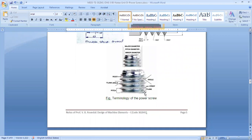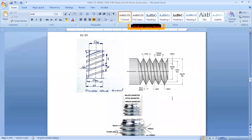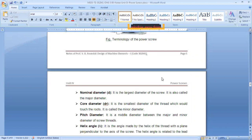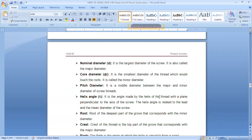In this actual photo of a screw, the smaller diameter is the core or minor diameter, the largest is the major diameter, and pitch circle diameter is shown at the center. Root, crest, flank angle, and pitch are all labeled. For this single start screw, pitch and lead are the same. These are the terminology terms we use for defining and calculating screw dimensions.